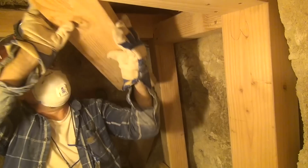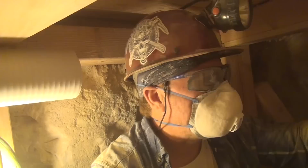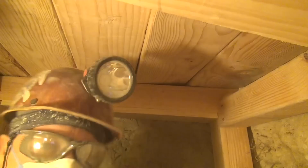I'm gonna tell you right now, son of Jim, putting lagging in is hard work. I tell you what, I'd rather be mucking all day than to put this stuff in, because the entire shape of the drift has to conform to the shape of these sets and the lagging. And you always get one rock that don't want to help out. It's always the last one that don't want to go in.